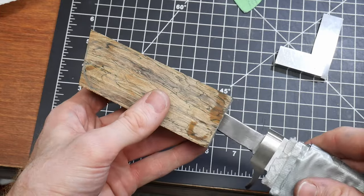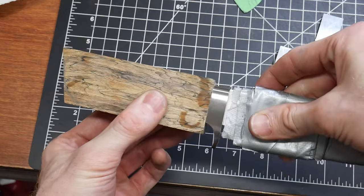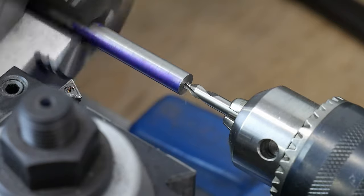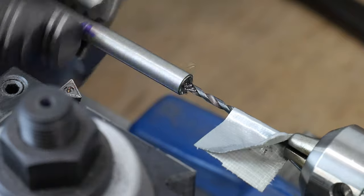As you can see, my tang fits all the way through the block and the threads come out of the quarter-inch hole we made on the back end. Having these threads centered in the quarter-inch hole is crucial to ensure a nice fit-up of the block to the tang. Next up we'll be machining the finial nut — I'm using a piece of 416 stainless rod that is 5/16 of an inch in diameter.